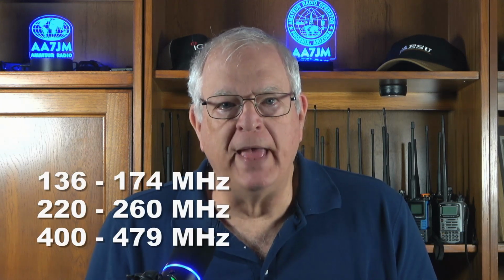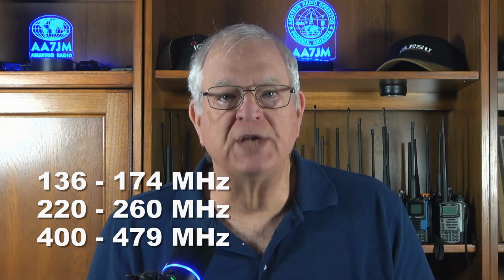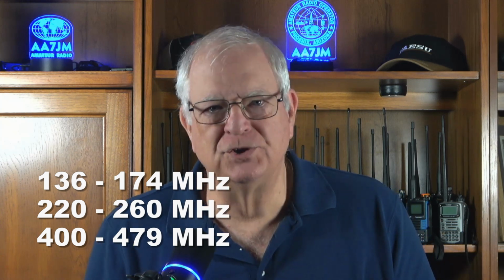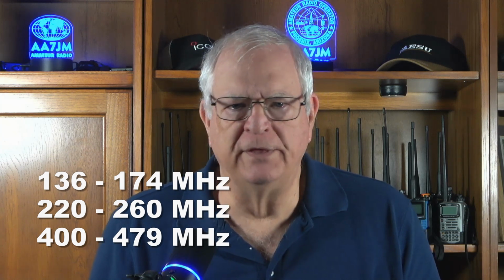Transmit and receive bands include 136 to 174 megahertz, 220 to 260 megahertz, and 400 to about 479 megahertz. The sales page says up to 520 megahertz, but mine wouldn't transmit there. That means you'll need to manage your license frequencies yourself. The radio is basically unlocked.